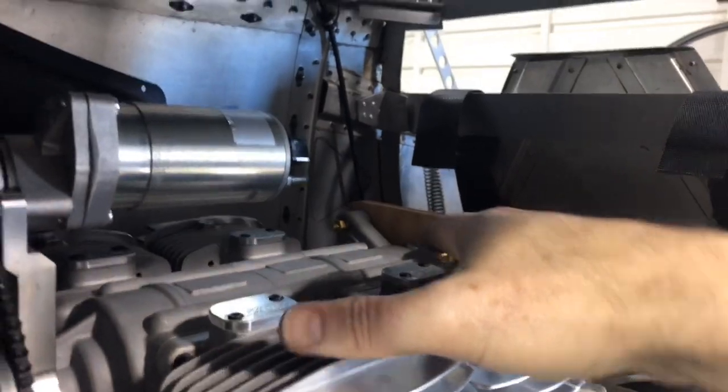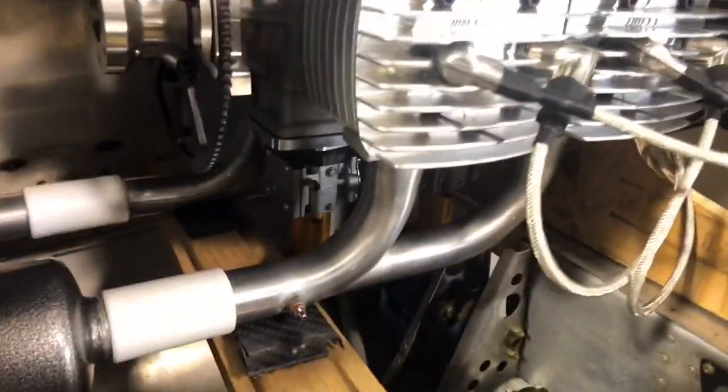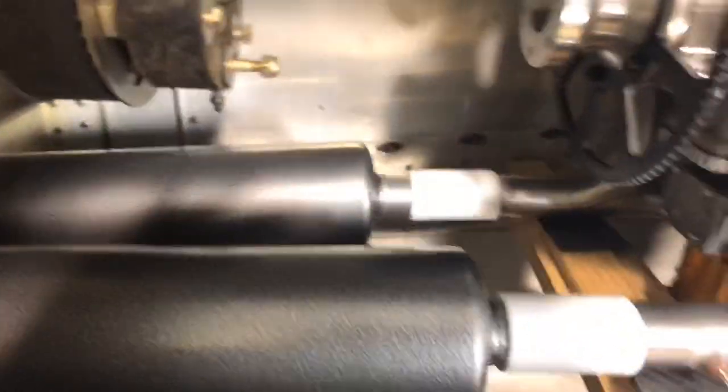This forces all the cold outside air to come in across the top of the motor, pass through these cooling fins, drop down across the exhaust, and finally into the exhaust jet venturi that Jim Beattie designed. For that to work I have to seal everything else off, so I'll probably get some RTV and put it down the center along where that flap control mechanism is, to minimize the airflow being sucked through that opening.